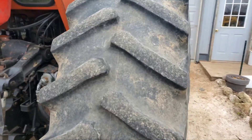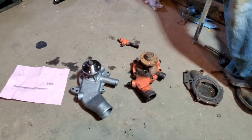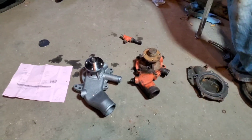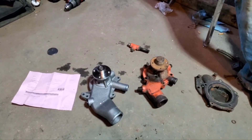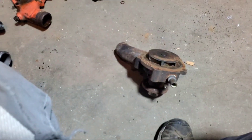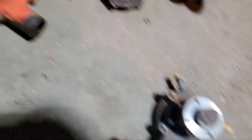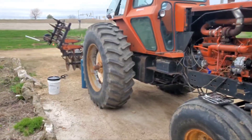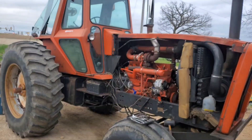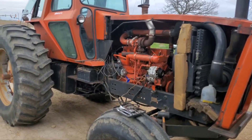So we're going to get this water pump put in and go get this hooked back up to the plow — first job this year is going to be plowing. These two pumps look very similar when not side by side; they both say they fit the same thing, a Gleaner M2, which is what that engine came off of — a 2900 engine. But one does not fit. Fortunately we have this used one that does fit; it's only missing one plugged-off port. This can't sit while we wait three days for a new pump, so we're going to put that used one on it and order a new one to put on the shelf for future reference.